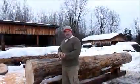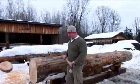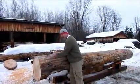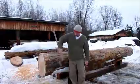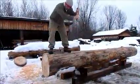And I think the first job in hewing a log into a square timber is obviously to make this face vertical and flat, following the blue chalk line that I snapped earlier. So what we have to do is make notches to the depth of this blue line.